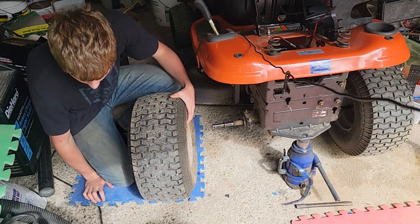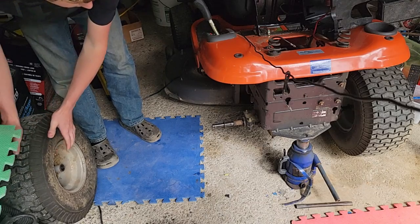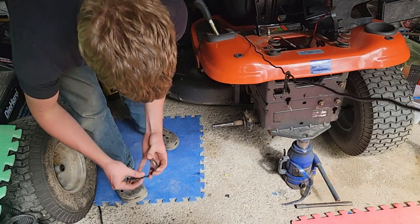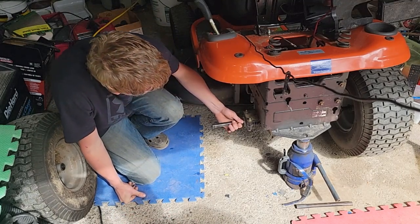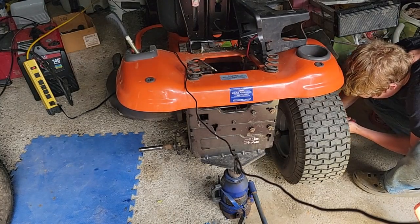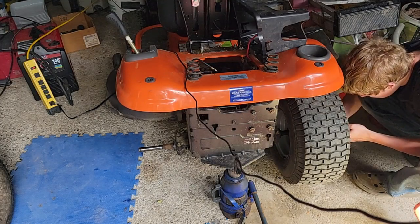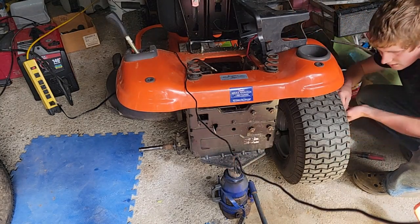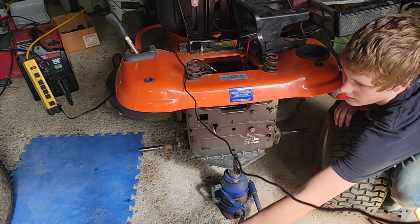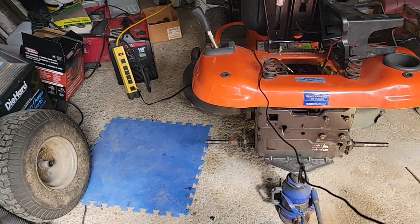By having a jack in the center like that, it can't tip to the side. Slide that out of the way — we got a washer on there, the key, and does that sleeve come off too? No, that's part of the axle. We'll go around the other side and do the same thing. While he's doing the other side, I pop the belt off the pulley — just lift up on it. The free wheel will slide right through the end so we don't have to disconnect that. We had that one rim that was all greasy, so we'll go ahead and clean them up while it's off.